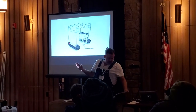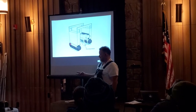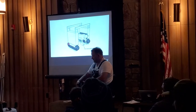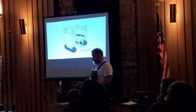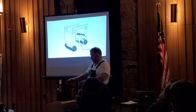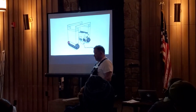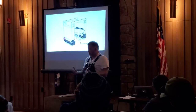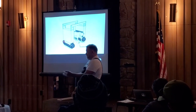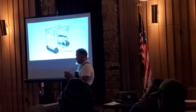The three biggest implements I'm working on are a compost turner, spreader, and scoop. A windrow mixer takes a bar through the middle and kicks it up — they're big. We're making one to fit on this that will windrow your compost; you want to mix it every three to five days and it will do that for you. Then you want to load your compost into your spreader, but we don't want a separate tractor for that — it's a big expense. So we put a scoop on this: it will scoop up the compost, put it into its own spreader, then go out and spread it. A full suite that takes care of your composting.